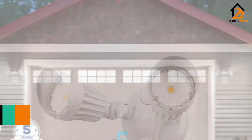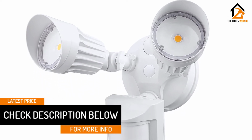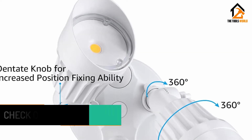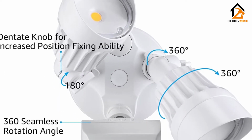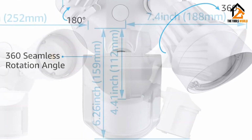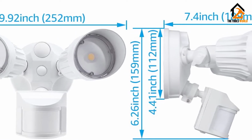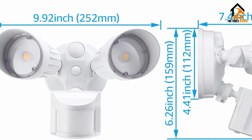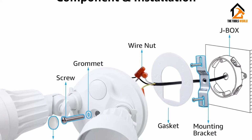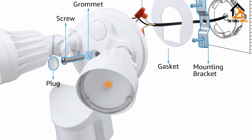The motion detection range proved impressive, picking up movement when we came within about 50 feet. Illumination is bright, and we could see the ground clearly for almost 70 feet. We were able to adjust the unit to use it as a dusk to dawn light by turning a knob on the underside of the motion detection module. There's also a knob to adjust the motion sensitivity. We turned it to its most sensitive option, and the light came on virtually every time a moth flew by. We finally found a happy compromise where only humans and large dogs triggered the light, but cats did not.